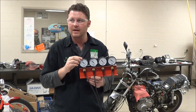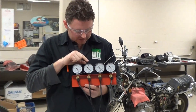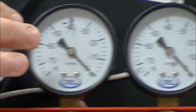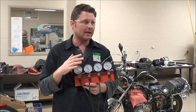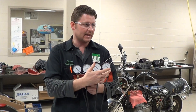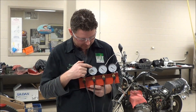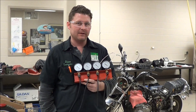There are two areas I want to focus on that we can make this tool amazing. The first thing I want you to notice — will you zoom in here — you'll notice how this one has a minus one written on it, handwritten, and this one says plus two. What I learned years ago was that the problem is, as much as they try to manufacture these and have them exactly equal, things happen — you have a little bit different tolerance. So one thing we always want to do is check our tool to make sure it has the capability to read the same. These two gauges, the reason for those markings, is that they don't read the same.